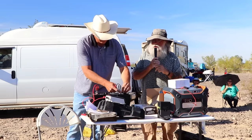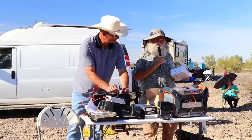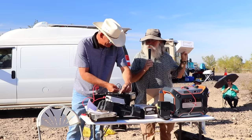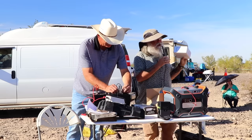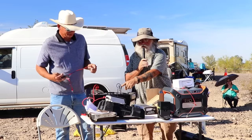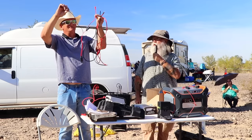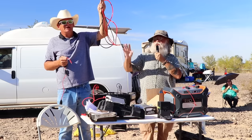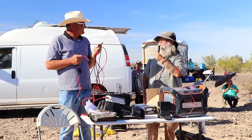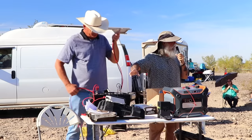The cigarette lighter clamps aren't very good — these are really cheap, thin 12-14 gauge wires. So I went ahead and bought a better 8-gauge wire. Smaller the number, the bigger the wire. You can see the size difference. This 8-gauge is a 40-amp wire at least. This is plenty of wire — it's overdone. It's 6-foot, so you can move it further away. It was $18 — a little bit of money, but I think the safety was worth it. It's plug and play; all you do is open this up and screw a nut on.